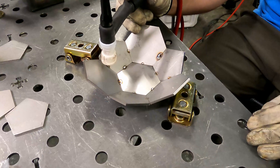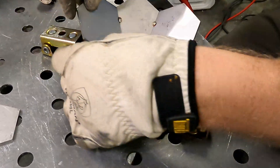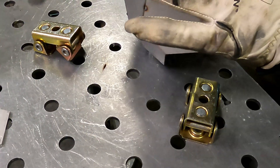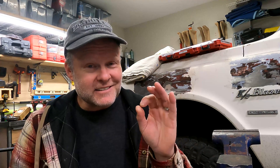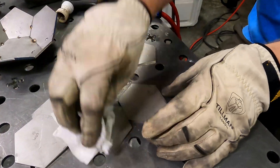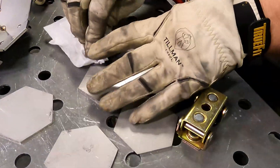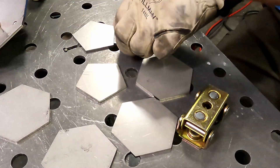The second part of the review is: how did I do? What was easy? What wasn't so easy? And what did I learn? Generally speaking, it was not that difficult if you've done any TIG welding on plain steel before. Cleanliness in stainless steel is super important — and even in TIG welding anything, cleanliness matters, but with stainless it's really, really critical. I think cleaning all the materials thoroughly is what made this much easier than I normally find stainless, because I'm not usually as diligent cleaning plain steel.